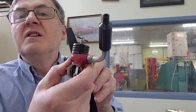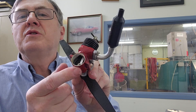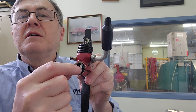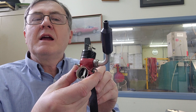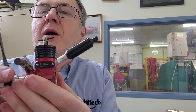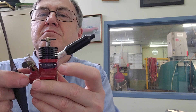In there you can see the crankshaft and the conrod. The conrod was an unusual thing — I designed the whole engine and then discovered I couldn't actually put it together, so we had to mill a little step in the conrod so you could slide it in, position it onto the end of the crank pin. We finished it off by putting a nice pressed metal plate with the logo on it and little brass pressed-in rivets, just to give it a different look — we're all about trying to add a bit of style.